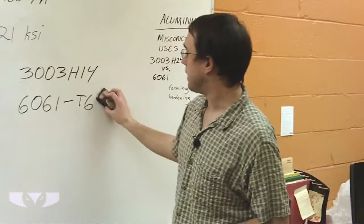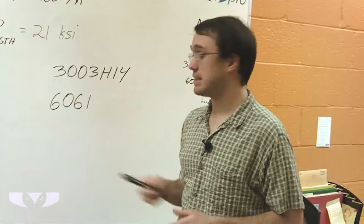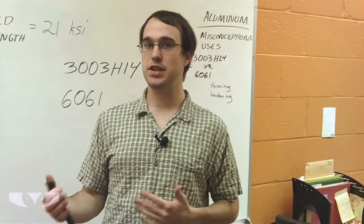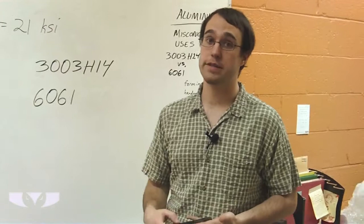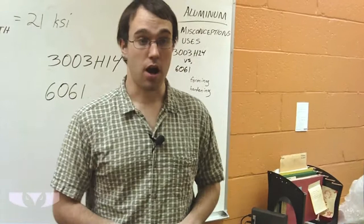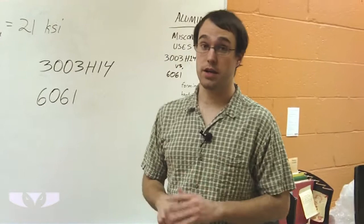Now, when people ask me for 6061 and I ask them why they want 6061 instead of 3003 H14, a lot of times they can't tell me. And the reason you'd want to use 6061 would be if you want to harden the material. So if, after the part's been made, you're going to use heat treat to make it stronger. Other than that, there's not a lot of reasons to use 6061 if you're not going to be treating it afterwards.